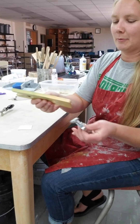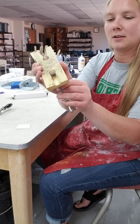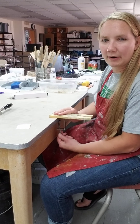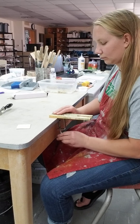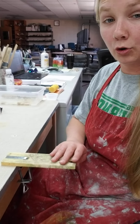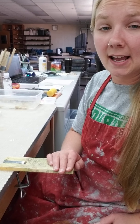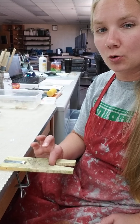Here's my bench pin. Remember, there's a little notch cut out — this is where the clamp part lives, and it's clamped onto the table where you are sawing. Your fingers never, ever cross over inside of the V of your bench pin, because that's where your saw blade lives. Even though the blade is tiny, it's mighty and it will cut through your skin.